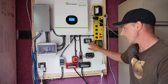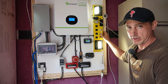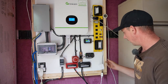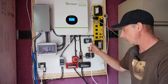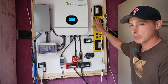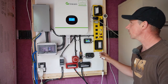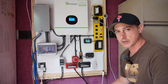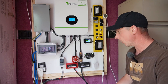Right now we're at 27.5 volts, and we're bringing in 18, almost 19 amps into my 24 volt system. I've just got lights here to go on/off. My power bar — I still need to clean up the Wi-Fi. Right now the Wi-Fi is connected through this little power adapter which runs up into the power bar. This is monitoring for the temperature sensor. I have one temperature sensor here, and then I also have another temperature sensor in my battery box, so I can see what the temperature of the cells are at any time through the Wi-Fi.